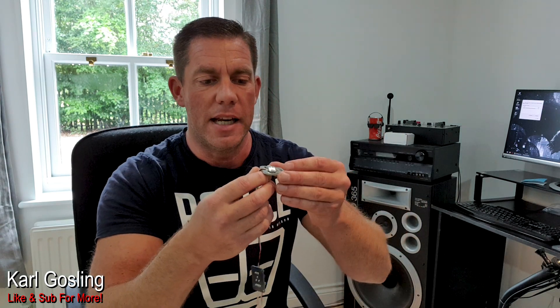Depending on the type of load cell, that either generates a small electrical current or it varies resistance based on a voltage input-output scenario. These are what you'll find in home digital scales as well, one on each corner, because they literally convert force into either electrical current or resistance. That's essentially what a type of transducer does — it converts one form of energy into another.